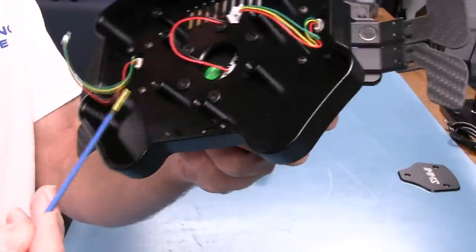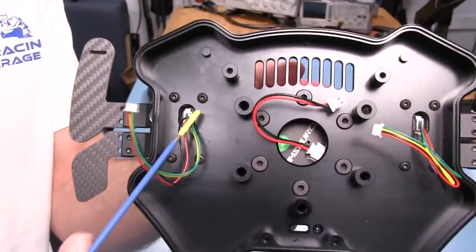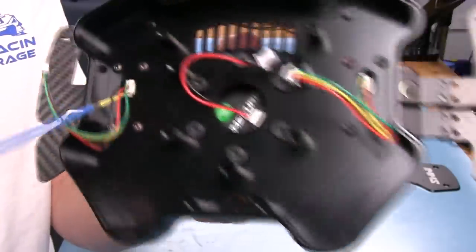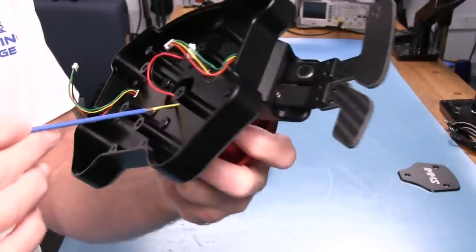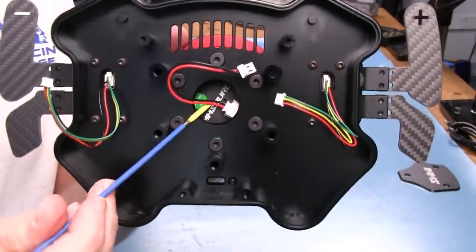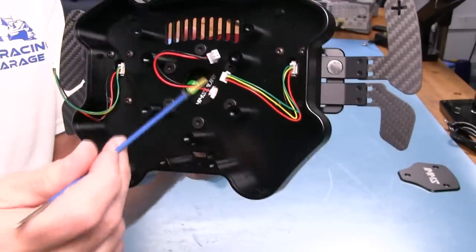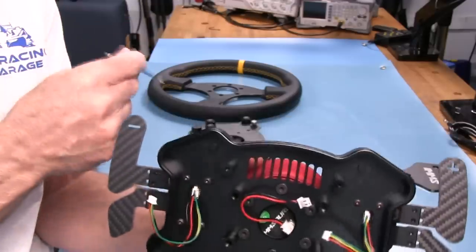So you can actually replace these. You can see we have two bolts on the bottom and on the top. You can pull those off and the whole thing will slide out. You can also unclip the plug in there if you need to. So that's on either side. And of course, this is the receiver coil. Again, we were talking about that magnetic coupling that we're using for inducting a current through this so that we get power to this plug, which again powers the board.